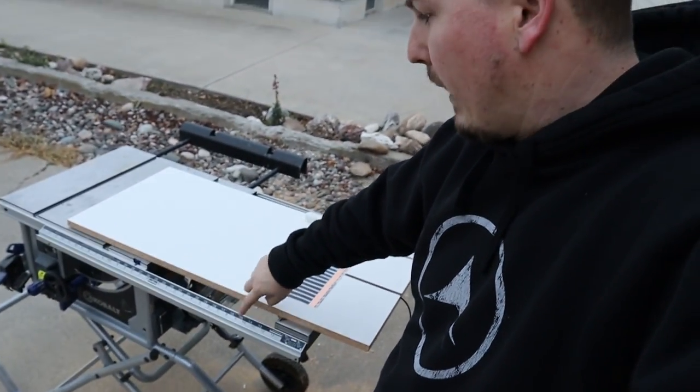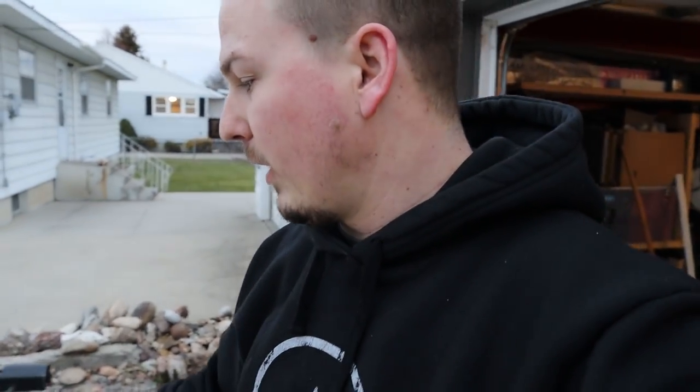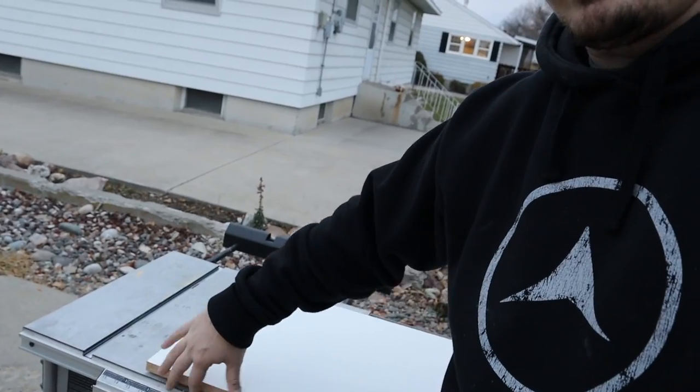Next step: I'm going to edge tape all the way around the whole shelf in one sheet before putting the shelves into the sides — it's way easier to do when they're separate. Any areas behind the side legs will still be sealed, which should help with swelling if water spills. Edge taping is not required, but I believe it helps melamine racks last a lot longer with all those raw edges sealed, especially in a snake room running 55-60% humidity.